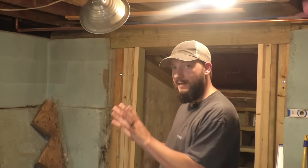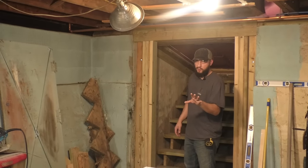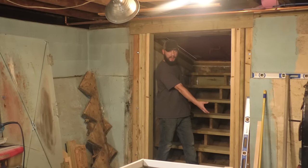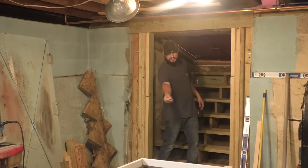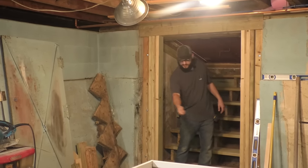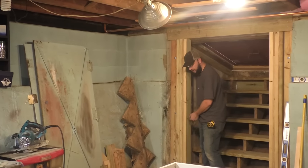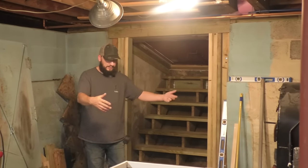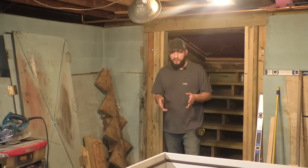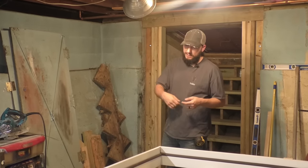I am at a point where I can check to see if this is going to be good, but I wanted to quickly talk about door swing. This is a right-hand in-swing door, which means if I have my back to the hinges, my arm is right here closest to the door — it's going to swing in this way. That's going to make it a right-hand in-swing door because I open it, it swings in using my right hand. I didn't want it to swing the other way because of this wall. So if you go to the store and it says LH or RH, that's left-hand or right-hand in-swing door.